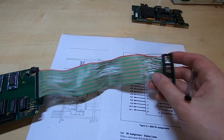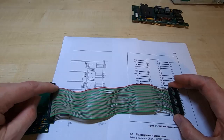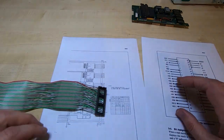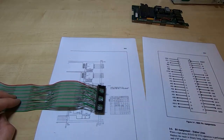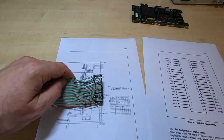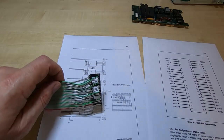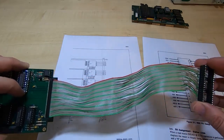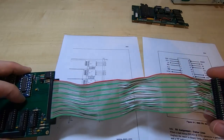And when you've finished, you'll end up with one of these — and it will work. It's exactly as the originals were wired, except it doesn't have the alternating twisted pair grounds, but it doesn't need those. You'll also find in the schematic and in cables if you've tested them, there are pins on the 0V rail connected together — that's not necessary either, though you can add links on the back if you want. I'll put on a sacrificial socket just in case I break a pin off the one I've made, but to be honest they're so easy to make — about half an hour. I make these four or five at a time.